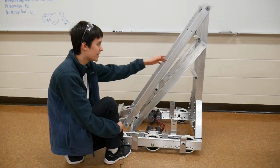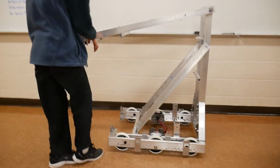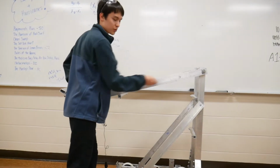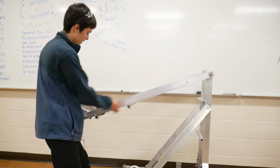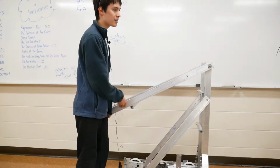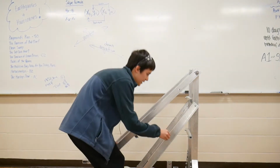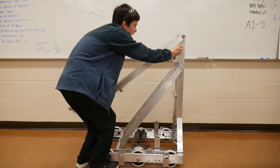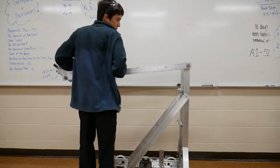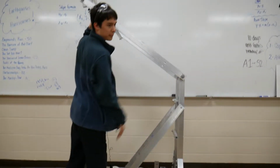And then keeping in mind that this arm isn't going to be able to shift lengths, it's going to come all the way up here, but it's not allowed to exceed a certain limit. So we had to figure out a good measurement for here to here that would still work for both of those limitations. And because of that, we had to do a bunch of calculations in trigonometry going from, say, resting position here up to this angle, which we'll say is 0 degrees, and then from this angle up to 7 feet high, another one like that.